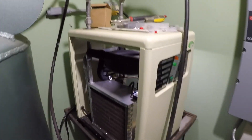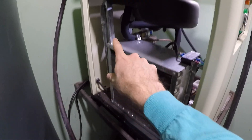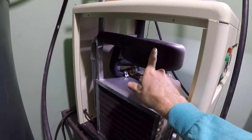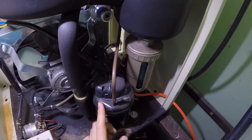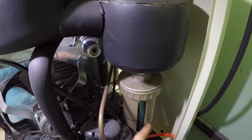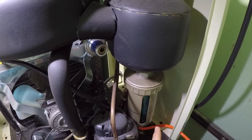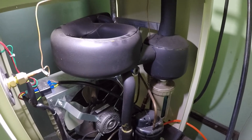For anyone who wants to know how this works: the air comes in through the line, goes into the radiator where it gets rid of the initial heat, then comes back up into the insulated system where it combines next to the refrigerant, which pulls the heat away. On the other side there's a compressor like you'd see in most refrigerators, a fan, and what looks like a thermostat. Once the cold air comes back out it goes into the separating system where the water gets separated out. There's an auto drain — the orange hose — that drains the water out once the pressure is taken off. The system works really well; highly recommend it.